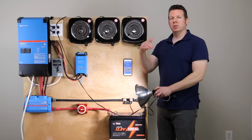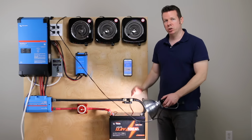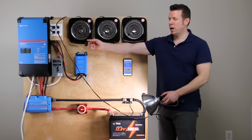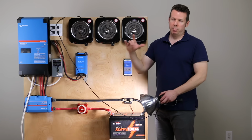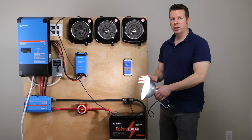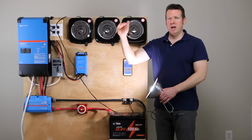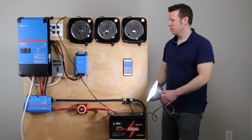So as it warms up, it will enable itself to put out more and more amps until it reaches room temperature, and it'll allow you to pull out the full rated power, or 90 amps for this stove. Full rated power being 100 amps. But I just wanted to point that out. So you can discharge it, you just can't completely discharge it at the maximum rate of 100 amps while it's frozen. So just something to note.